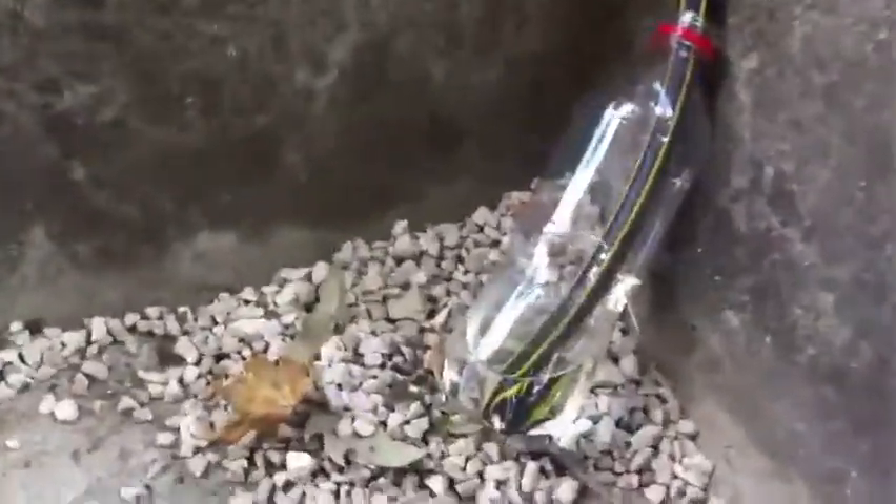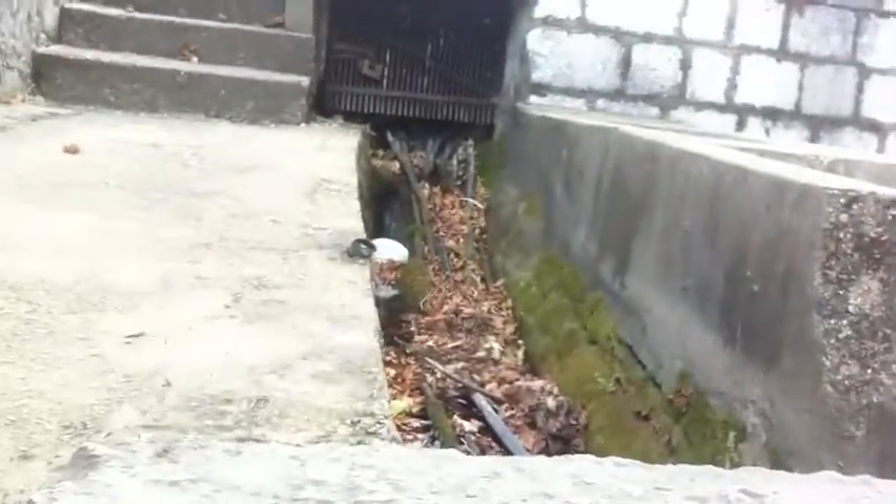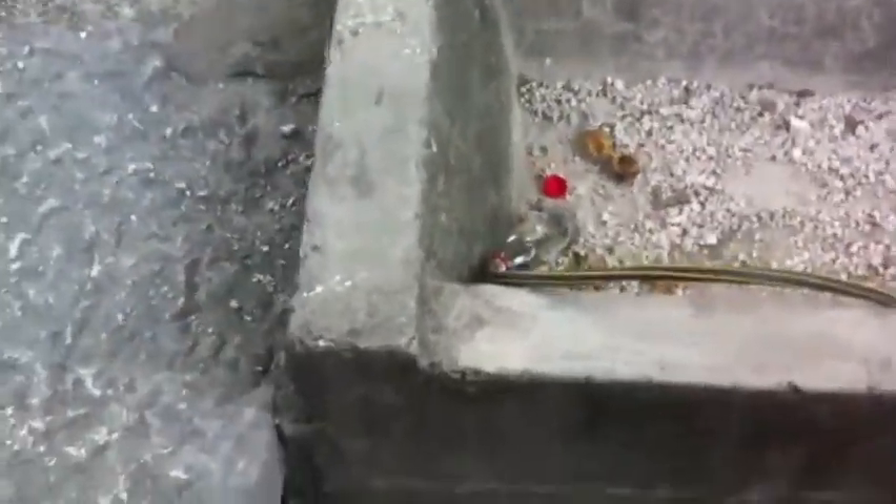Just to show you: when I do it manually, I get some water up here, which is very nice. This is probably half a liter. Just by clicking it 10 times I get probably 300 milliliters, which is very nice. And this is already a bit higher than where it started — probably half a meter, maybe a little bit less, about 30 to 40 centimeters. So I get the water higher, everything works fine. I just don't get the valve to self-operate.